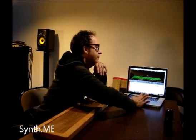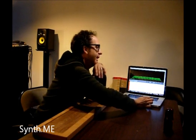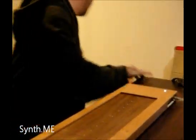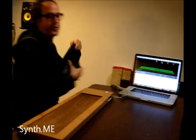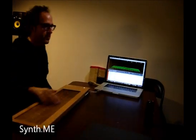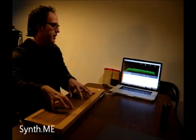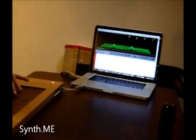Right now with the alpha software, you bring the sound plane up and say calibrate. What it is is a network of sensors — the sensors actually detect the position between a bunch of metal plates just inside the top of the device and a bunch of plates further in. Between them there's a layer of squishy foam. So we've got metal antennas on top and metal antennas on the bottom, and based on determining the distances between them, you can get all of these multiple sensitive touches out of it.